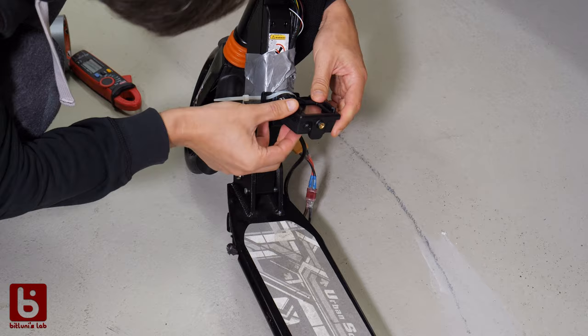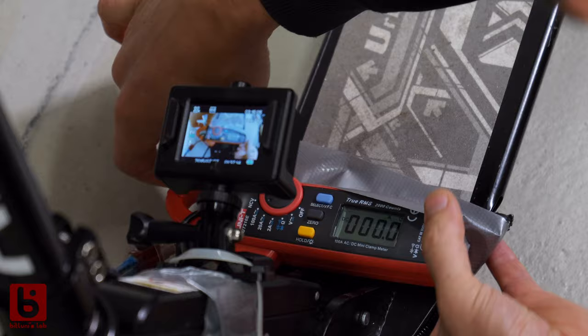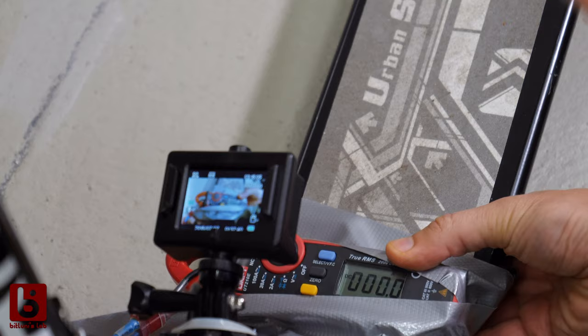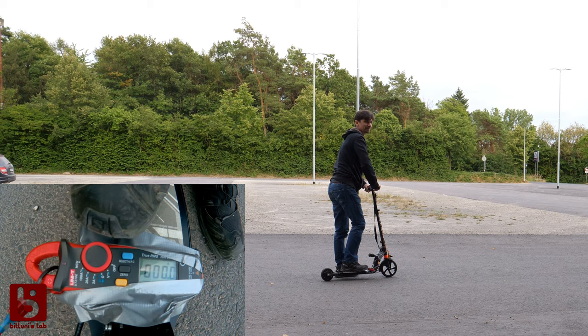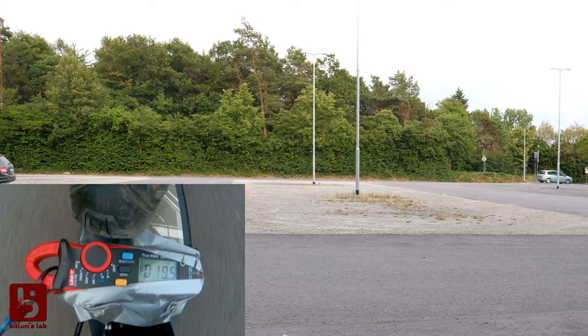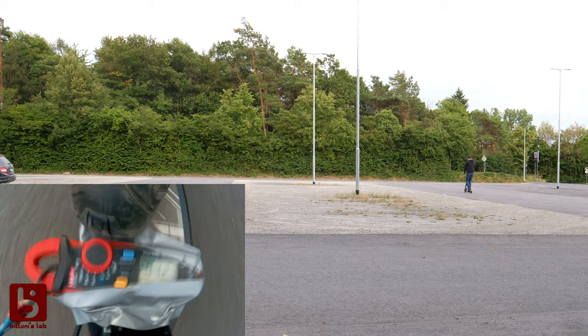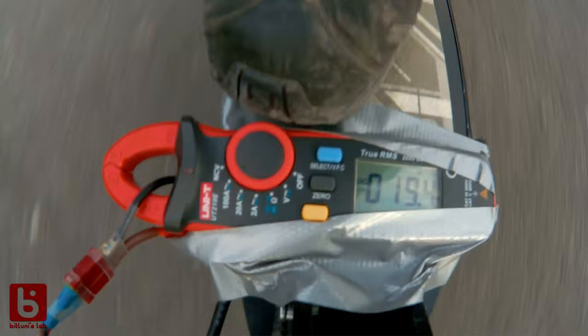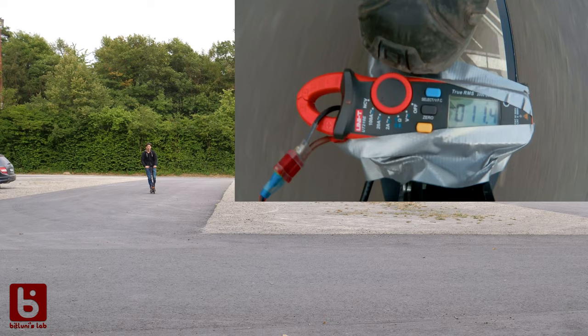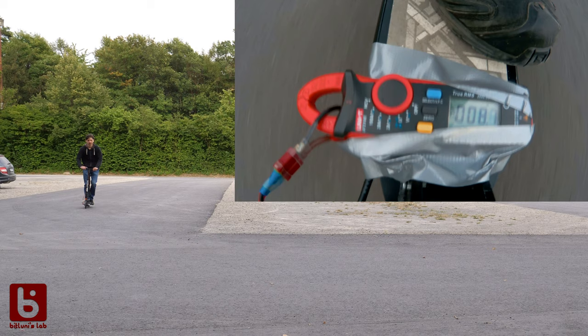After a short test I increased the current limits to 30A and 20A to get faster acceleration and braking. To test the actual currents I will use an action cam that will record a clamp meter measuring continuously. During acceleration the controller takes up to about 25 amps from the battery. The braking recharges the battery again at around 8 amps, which should be acceptable for these type of batteries.